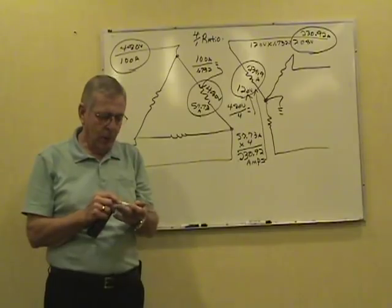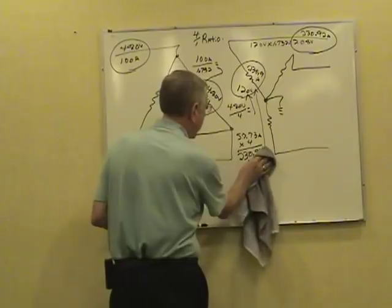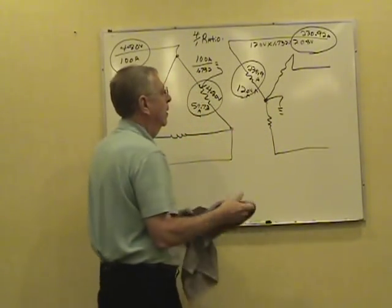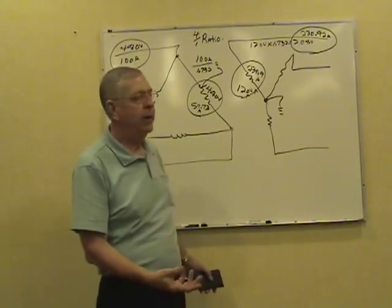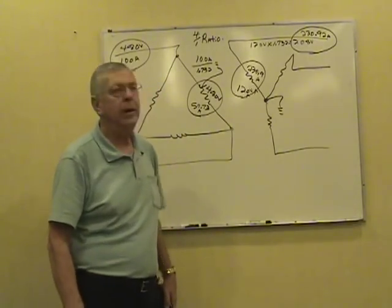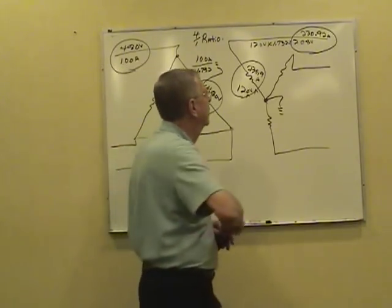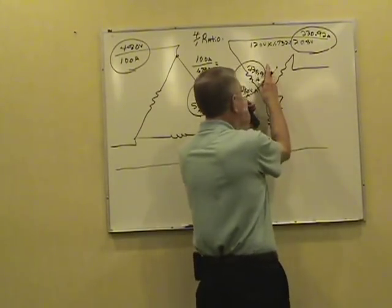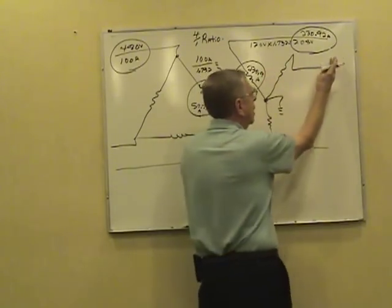Okay, let's see. What else can they do to us on this thing? Total three-phase load. On a delta Y connected 480-208-120 three-phase transformer, secondary line current is 230.92 amps. What's the total three-phase load in volt amps? This is where the three-phase happens, out here. If they give you a question in the phase, that's a single phase. That's one phase. Now, three-phase happens out here.